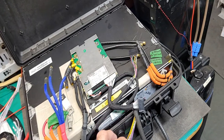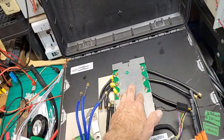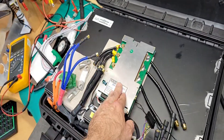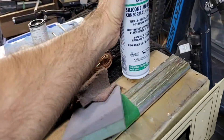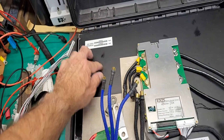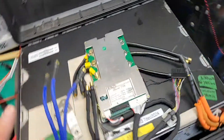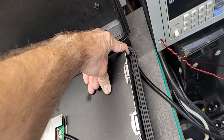I don't want a vacuum created by differential pressure causing water to go inside. But even if water gets inside, the entire BMS including the PCB has been covered with conformal coating, which is perfect for electrical insulation. I've also paid attention to having fiberglass tape covering the parts between the semi-conductive anodized aluminum sections and the connections, with good spacing below — paying close attention to waterproofing overall.